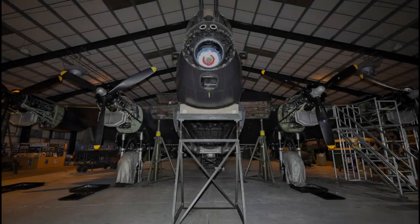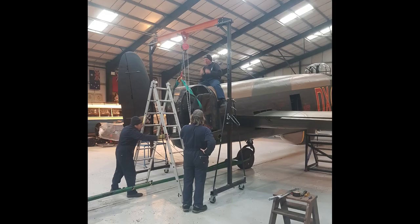I've been taking some video and some photos as we've been going along, taking the aircraft apart, and you'll be able to see them in a few moments with a bit of commentary to talk you through the removal of the rear fuselage section and all of the flying controls, fins, rudders, and tailplane. So with the main bulk of work this winter being the strip of the aircraft to facilitate the fuselage splitting at the rear transportation joint, we wasted no time in getting parts of the aircraft ready to strip for that fuselage split.